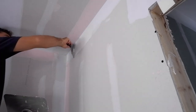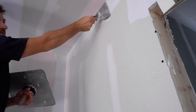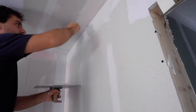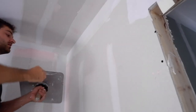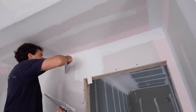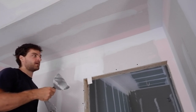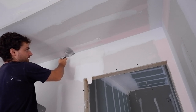From this point I can carry on with any corner I want. With the exact same method, I'm putting the mud on there making sure it's going into the corner, running this side of my knife against the ceiling. If I've laid my tape well, that corner should be pretty much perfect. One thing I should mention while doing this is you have limited time with this coat because as you start spreading it — it's so thin — it starts to dry out really quickly. So you want to be careful you don't play with it too much because you'll make a mess. If you don't like the way it looks, or it's starting to drag dry mud into your wet mud, either leave it alone sooner rather than later, or clean off the mud you just laid and start again.